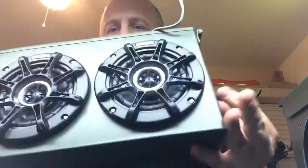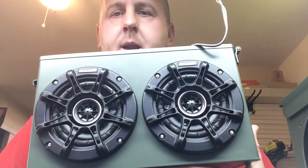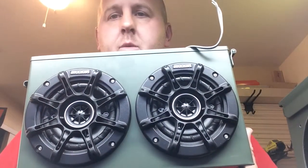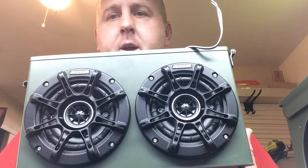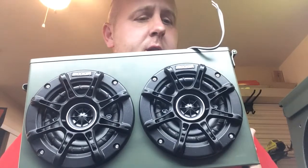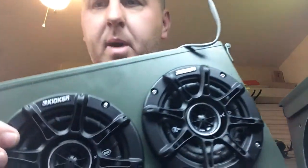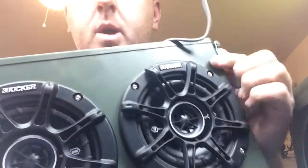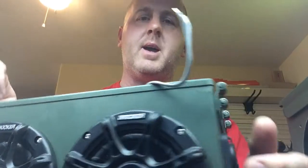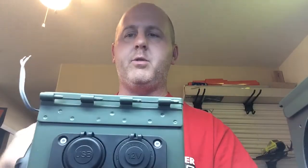Once you drill your holes, the speakers are pretty straightforward to mount. You just need to line them up straight — I literally just lay out a ruler to make sure the holes are straight, mark them, punch them with a hole punch, and drill them out. I went ahead and pre-bought a few extra M3 screws and nylock nuts to put on the back end of them to ensure they won't come out.